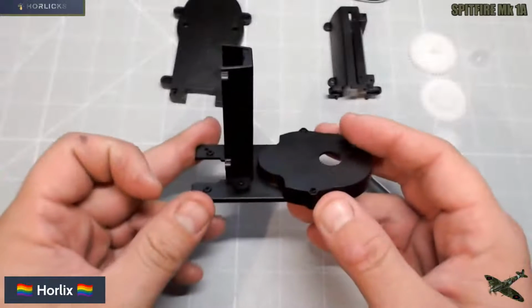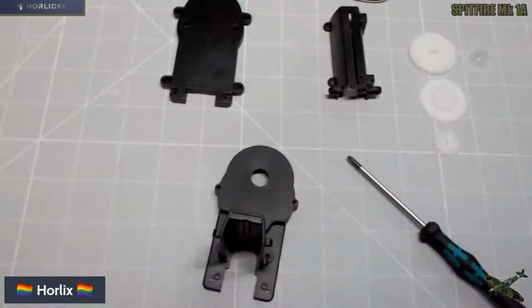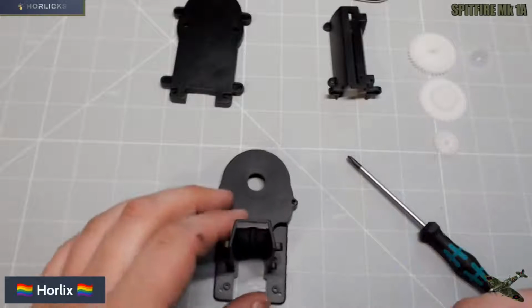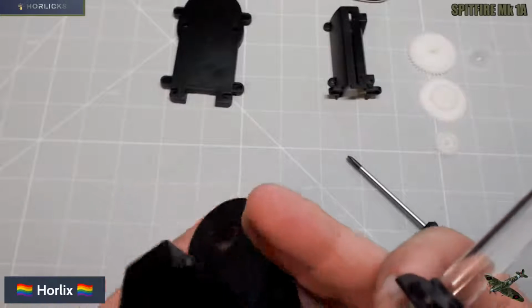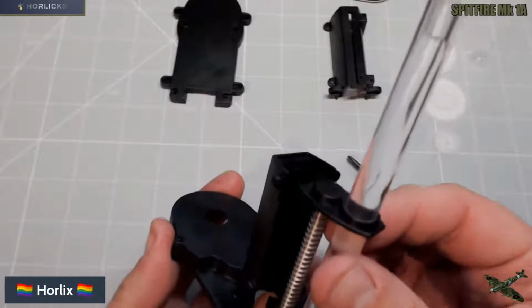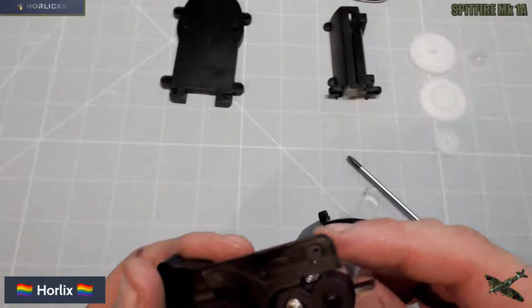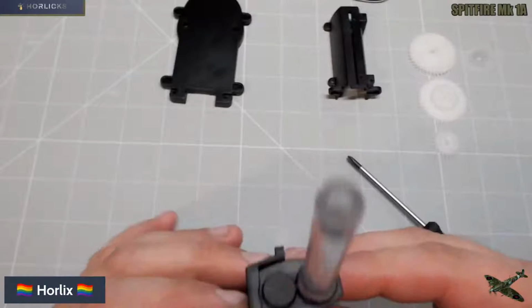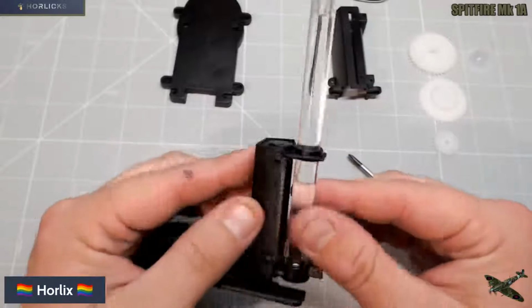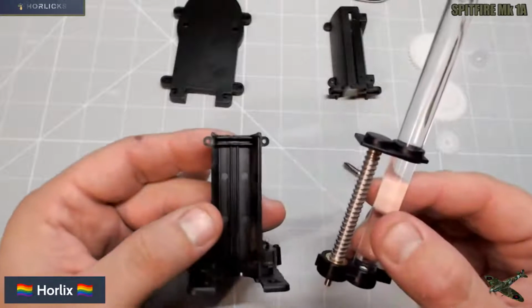Okay, so that's step 6 sorted. Step 7, and that's fit the rod assembly from step 5 into the recesses in the upright housing 8103, so that the steel rod 8112 is inside the housing and the vertical tab on part 8106 fits into the slot on the inside of the housing 8103, red arrow. The horizontal tab at the top of part 8105 fits into a slot at the top of the housing, yellow arrow.